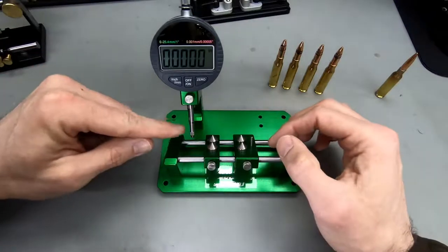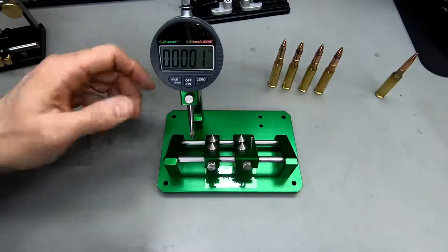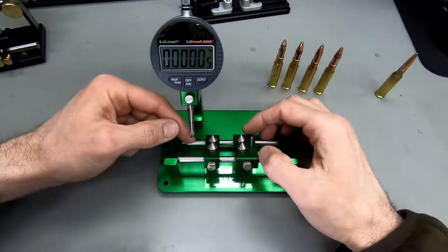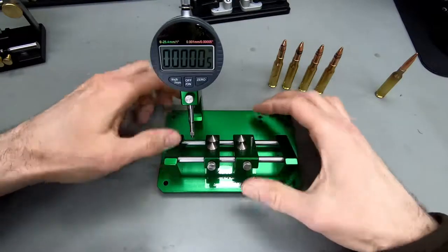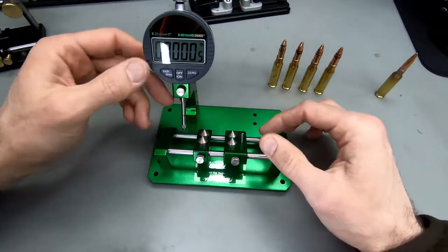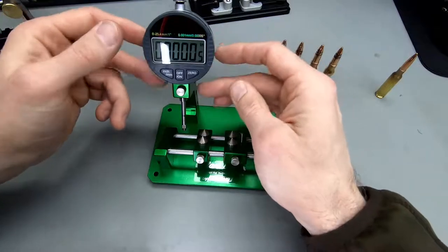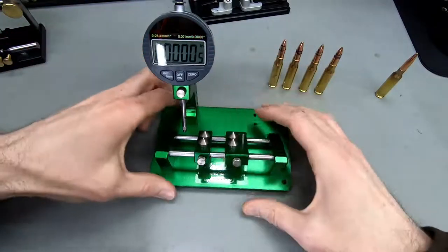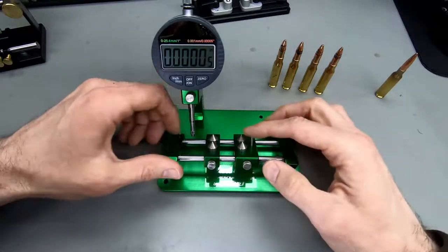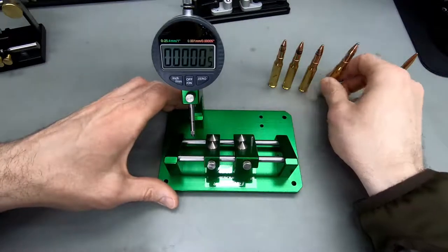So you need a gauge that has a 1-inch measurement tip, like let's say a 1-inch tip down here, to get all the way down to where you want to measure. This is one of the drawbacks of having this fixed arm construction. The benefit of it is that the whole dial here is already angled at a very comfortable position to use it. We're not going to use an analog dial here because it works really well with a digital dial here. So let's just get started.